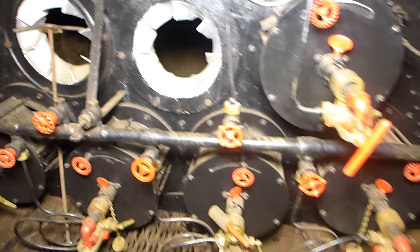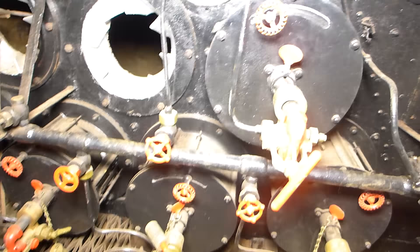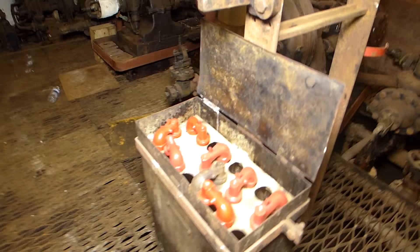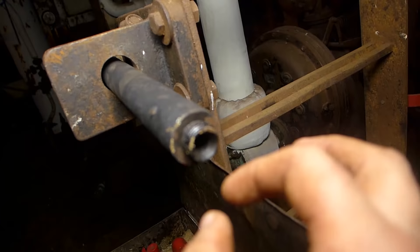After a while, because of the intense heat involved, fuel would carbonize on the tips of those burners, so they had to periodically shut burners off. They would come over and switch them out for ones in storage, and then they could clean that burner tip. The way they would do that is they would take that burner and set it in a jig, unscrew the cap, remove the little disc, clean out the orifices, screw the cap back on, and then it could go back into storage.